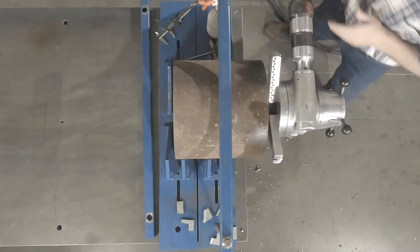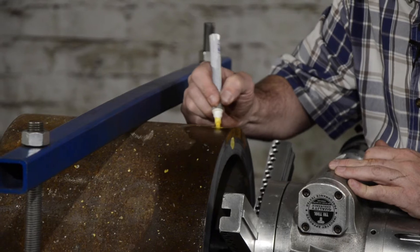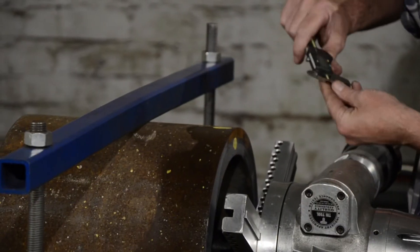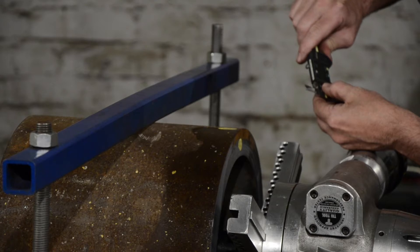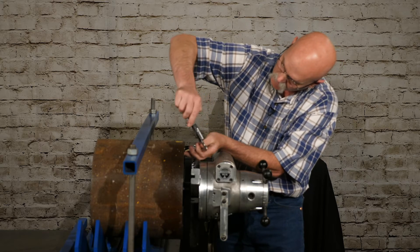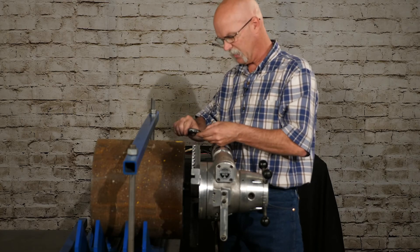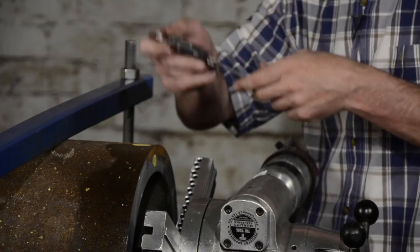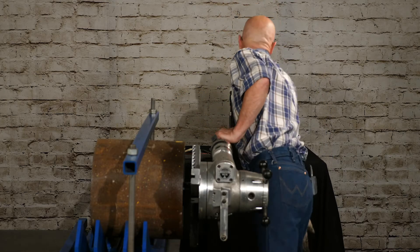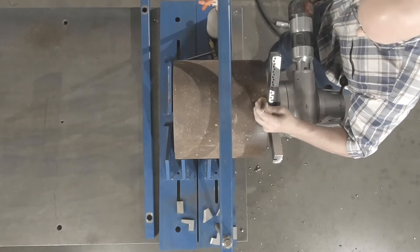What we're going to do is take a paint pen or a sharpie and put a paint mark on the top. Take calipers, set that at 750 — three quarters of an inch — to mark this end of the pipe on the front, because that's where your transition mark is. Then we know the top has to be all the way back at 686, and we mark that. It's best to put a punch mark instead of just scratching a line so the chips don't end up making the line go away.